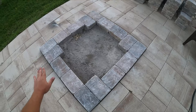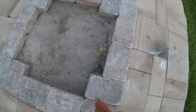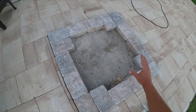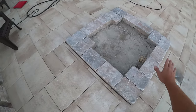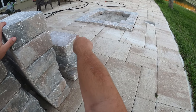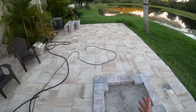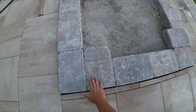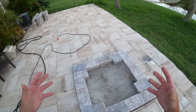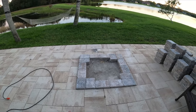First layer is in. I do have to make a few cuts right here, right here, and right there, and then we have a nice perfect square. I went super anal — not just regular anal but super anal — on leveling this out. You can see that side over there is lower than this side, but it's all leveled out. The first layer is the most important because you want everything as flush and level as possible, otherwise it starts to compound and create issues.